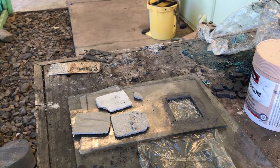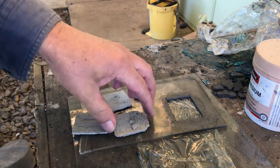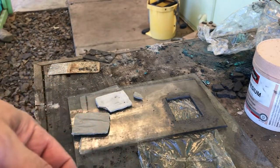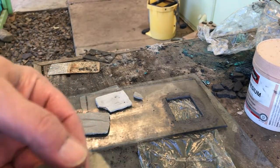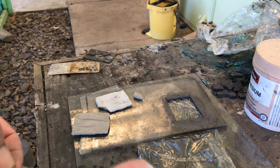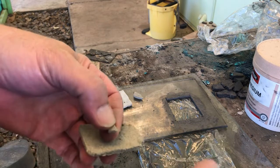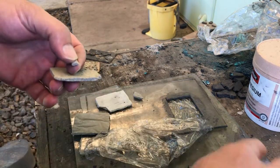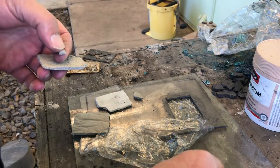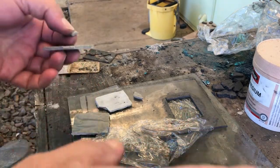Welcome back. I've been working for the last six weeks on these little things. I did first try plaster of paris, which has a binder, but it was all right for the first day in electrolyte - after that it started going soft, and the resistance would go up. So that led me to making something different.